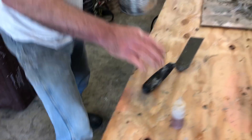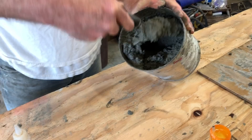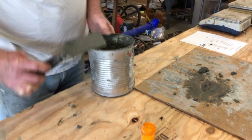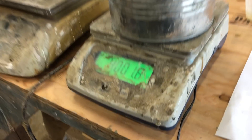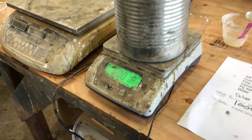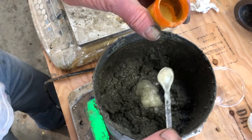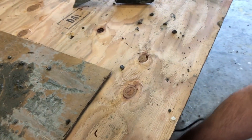I'm gonna mix it up here with a paddle mixer. This concrete is a little bit on the rich side. For the purpose of this experiment I made a six and a half sack mix with effectively two sacks of fly ash — otherwise it's just a normal pea gravel mix. And I'm gonna go ahead and add our thickening admix. So that would be one cubic yard of concrete, more or less. Normally we do about 10 pounds of this admix — I'm gonna go about 15. So this is the equivalent of 15 pounds of admix per cubic yard.